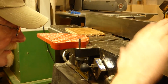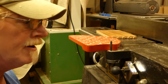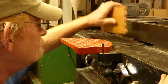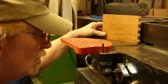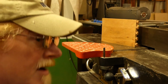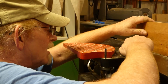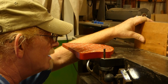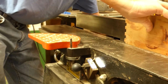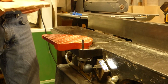I figured out that they've got basically dovetails that hold the casting onto the base. So I just made a minor adjustment, and that took the play out of the table. The last thing I want to do is, since I've dropped and made adjustments and have new blades, it's taking off just a little bit more than what I want. A lot of our projects are kind of small. It takes off a pretty good amount, which is okay for rough lumber, but a lot of our work is a little bit more delicate than rough lumber. So I'm just going to eyeball it a little bit less, adjusting my infeed table, and we'll test it. That's good. I can tell by the sound. It's taking off a lot less. And we're pretty much done.